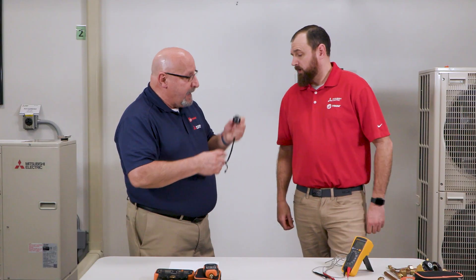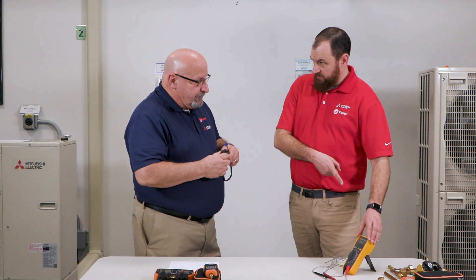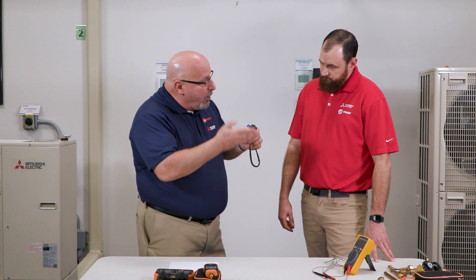What we're going to do here today is we have a sample of an LEV coil. It's magnetic in the sense that there's a pulse 12 volts DC signal being sent to the coil, opening and closing the valve. You could measure it — it will show you the 12 volts DC signal, but it's not going to show you the pulse because it's so quick. Typically when you first power up a unit, you'll hear a tick, tick, tick, tick — that's the LEV finding home, or finding the fully closed position, which is its reference point. Everything else is referenced to that point, so then the valve returns to its normal open position. That pulsing goes on, opening and closing the motor that's internal.